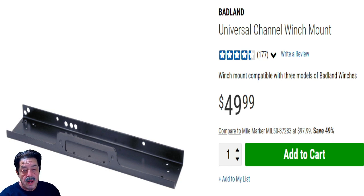So in a nutshell, you want to be very careful about how you're going to mount this. Read into it and figure out the best way, especially if you're going to put that kind of demand pull on it. The mounting bracket will work for light duty to moderate use, but if you're going to use it for really heavy pulling — say, 12,000 lbs at full capacity with the 12,000 lb Badland winch — you're going to bend the heck out of this bracket. It's not going to withstand it.